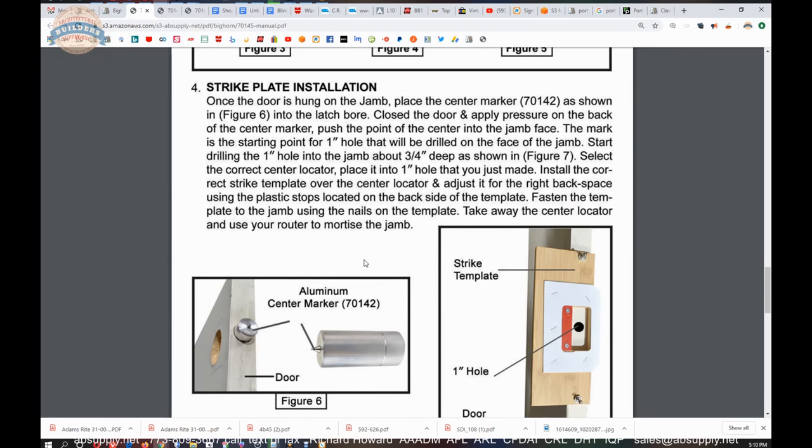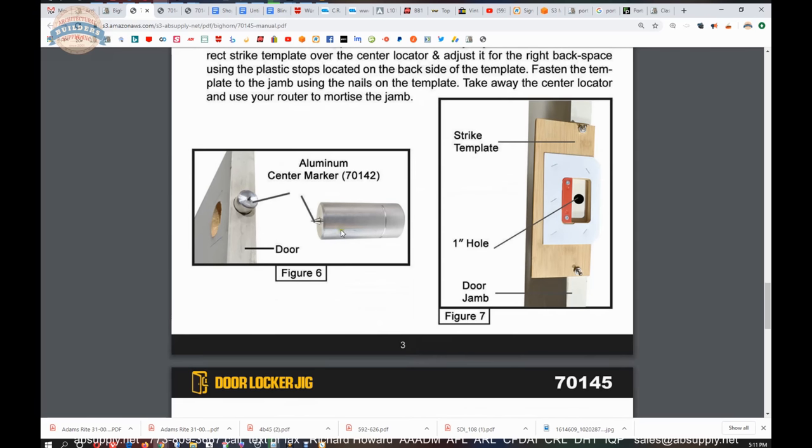And again, the handyman, the locksmith, they enjoy the step by step process. I wouldn't say that they enjoy it, that's the wrong term. The reason that they'll look at me and say, how do you prep the door without a kit? Is because these steps will keep you from doing it wrong. And that's why I think people love it. Because it forces a repeatable pattern every time you prep a door that eliminates the possibility that you're going to screw something up. And that's the beauty of templates like this.